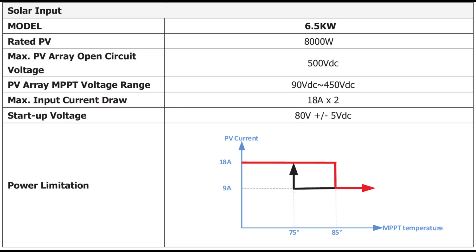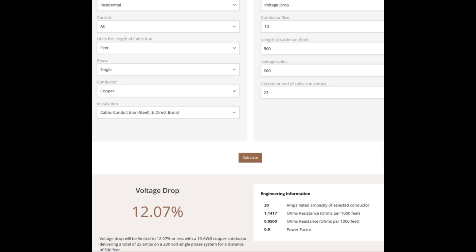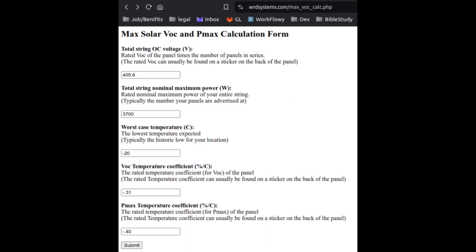The reason I care so much about this high open circuit voltage is because eventually the wiring for these solar panels is going to run about 500, maybe even 1,000 feet from my home — probably closer to 500 or 600. With a voltage drop calculator, the biggest consideration is your current. That's where they call it I-squared-R losses — your biggest factor for losses comes at the square of the current. If I had to parallel some panels, that would really increase the amperage and be a lot less efficient, requiring a bigger wire size. Keeping them in series at around 400 volts in this case — since STC is what you use for safety calculations — avoids that problem.